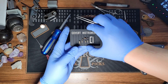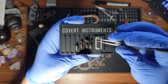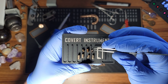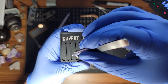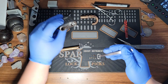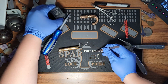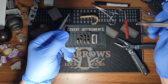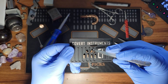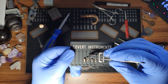What's really cool about this lock — and I was not expecting it — were these mushroom pins. I was not expecting that at all. Some videos I've seen had serrated pins in there. You'll also notice that the pins are different lengths, which does add a different feel while picking. The springs are pretty standard too. This is a 124-year-old lock and everything is in really good condition, with the exception of just that fourth pin. I would say these are definitely the original pins based on how they look — they don't look new or replaced.